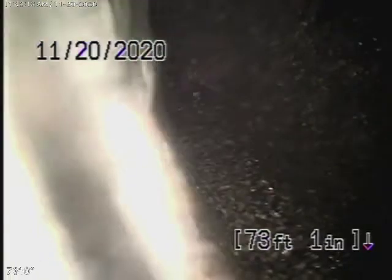We're going to pause the recording and run the camera from that 4-inch clean-out. We're running our big camera through the line now, through the 2-way 4-inch clean-out. We're all the way out to the city connection — just a little slightly dislocated right at the end there, so we just get the camera to see the city connection.